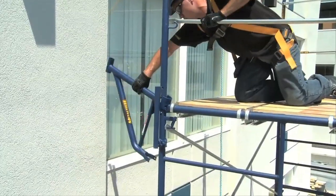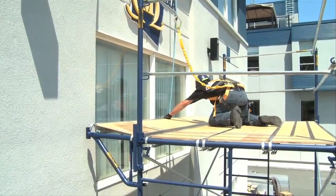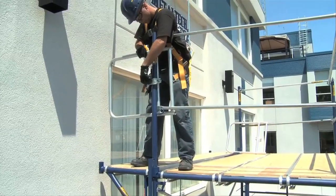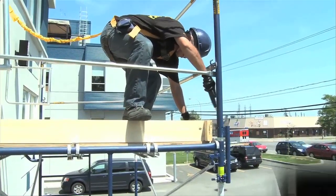If you are far from the wall, you can install side brackets and an additional platform, and you can't forget to extend the guardrails. To prevent equipment or tools from falling, you must plan on installing toeboards or planks on all sides of the platform. It should be noted that the height of the toeboard varies according to local regulations in effect.